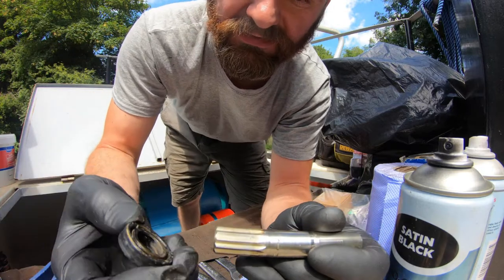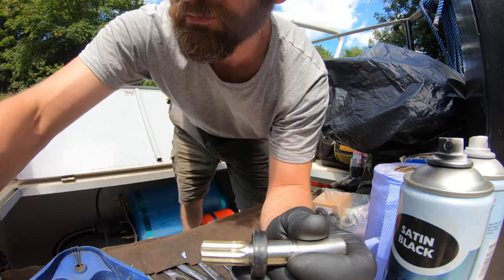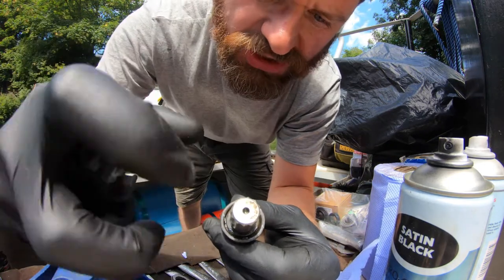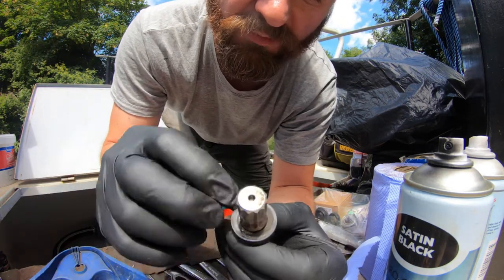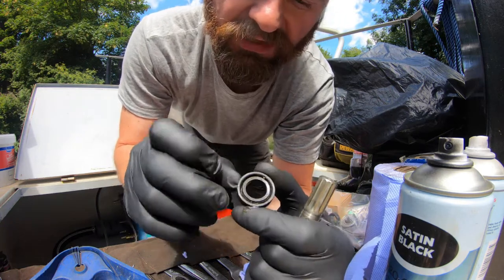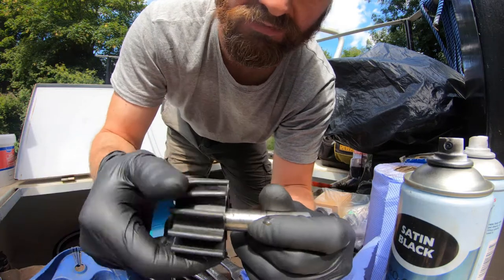So basically what happens is the lip seal wants to work with the lip facing that way, because on this particular part, this is what drives the impeller. So the water pressure is on the inside here, pushing against it. So the way a lip seal works is pressure will go inside the lip and the pressure will push the lip into the shaft that's rotating. If you had the lip seal on the wrong way round, for the point of pressure, the pressure would work its way out because the springs would just lift out. So you need to put the lip seal on the point of pressure. So in an engine, for example, where the oil pressure is, you would see that this side is facing inwards. And that's why you see that like that. So yeah, that's basically a splined shaft, drives the impeller, like so.